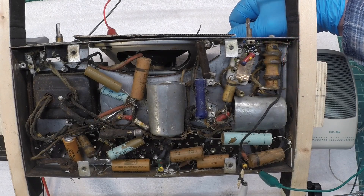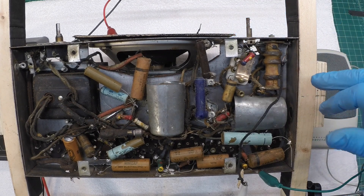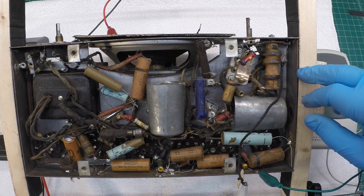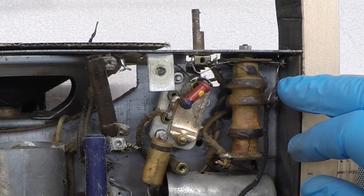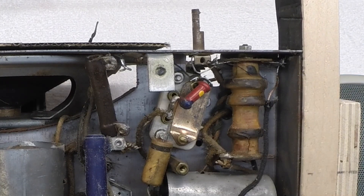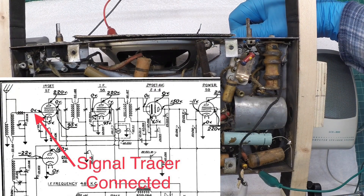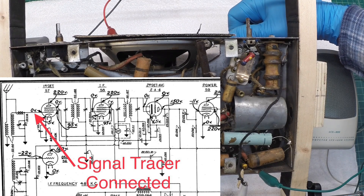For a new generation on TNG Radio. The receiver is actually not playing — I'm just testing the front end of the receiver, that being the antenna coil that loops back through the tuning condenser. I'll show my hookup locations here on the schematic in just a moment. You can see I'm using the signal tracer and I'm actually able to tune around using a long wire antenna and RF ground.